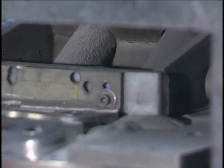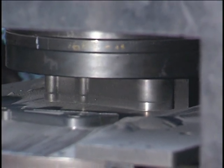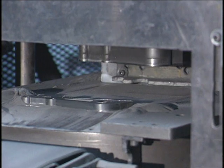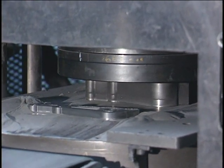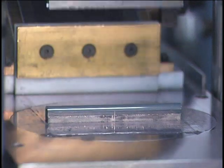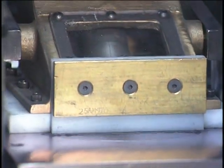In mechanical pressing, the powder is automatically gravity fed into the die of a mechanical or hydraulic press and consolidated to a specific density. Pressures of 10 to 60 tons per square inch are created by the vertical action of an upper punch, or by the double action of an upper and lower punch. Pressing is typically at room temperature, although elevated temperatures can also be used.